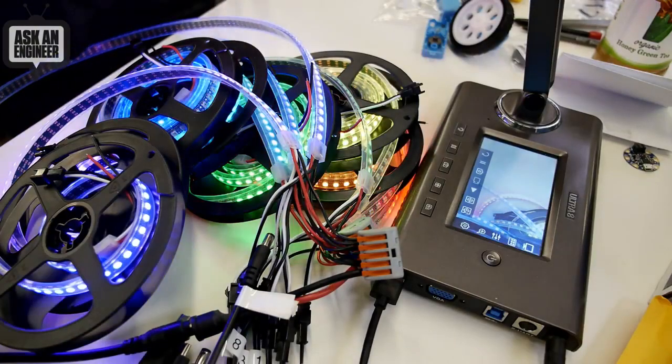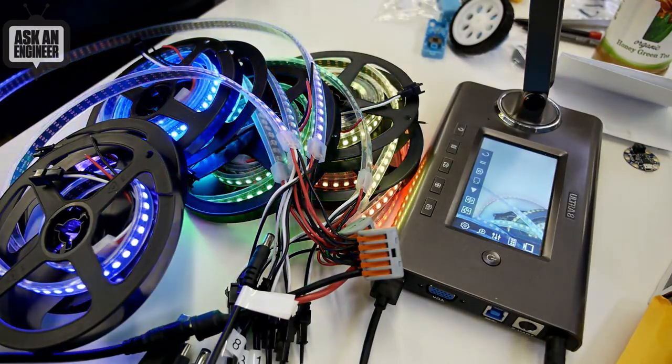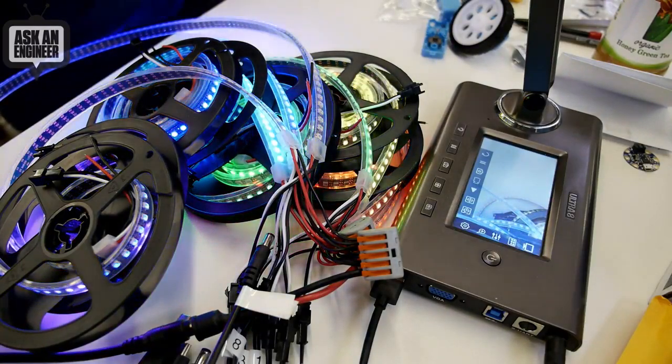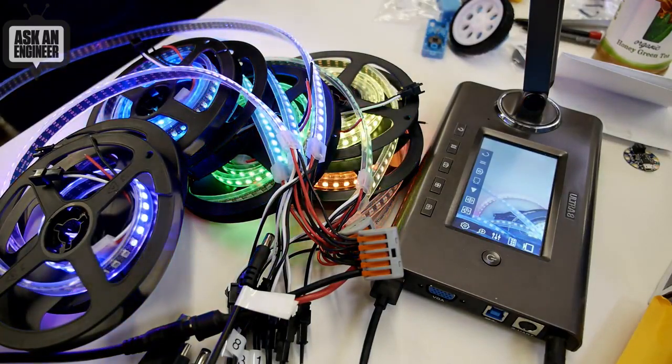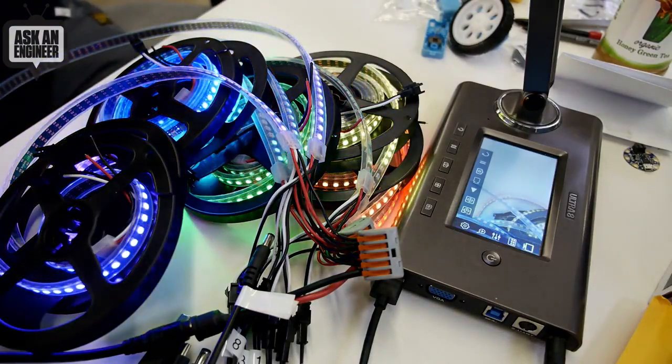So the microcontroller itself isn't actually doing anything but setting the color memory data, and then letting the firmware handle all that pixel pushing in the background. You can do up to about 2,000 pixels total. That leaves you plenty of memory left over. And the wing itself, let me grab one.